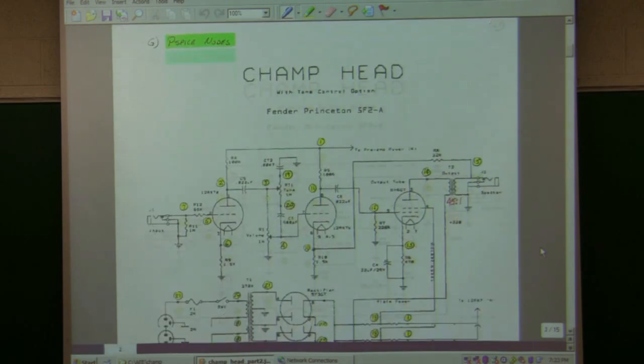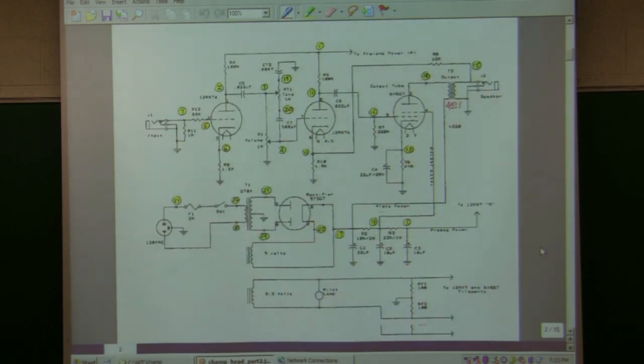It's the same schematic now, but putting node numbers on it. And I'm going to run the simulation of the whole system together. A lot of the node numbers last time were just that, cutting out these pieces and running them separately without the loading of the next section on it. So we'll see some of the gains will drop a little bit. Also, the kit came with a 45-to-1 transformer, and I want to show you that has an effect on the overall power output. Some discussion about how to change some of those things.